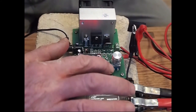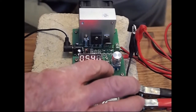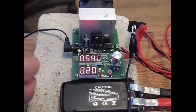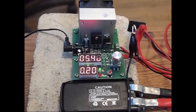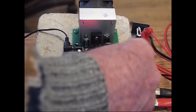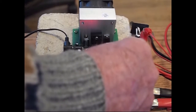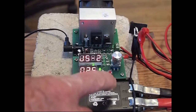Function 2 is battery discharge test. This is beep on, and this sets the upper one — it's upside down from where I'm sitting. So the shutoff voltage is set at 5.4 and the discharge rate is set at 200mA, so we're going to set it up for — actually going to make it 250mA — and then we start the test.